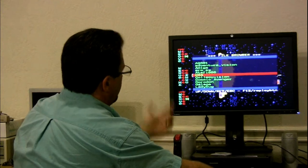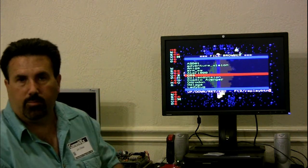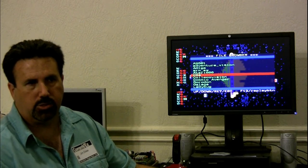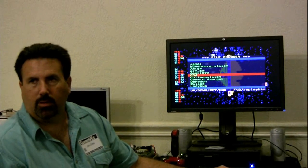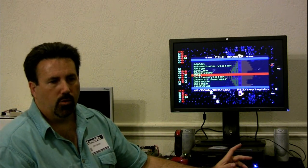Besides video games, they're also really into computer emulation. The reason this is taking a long time — this board has a copyright of 2011 — is that these guys are meticulous about doing exact emulation of chipsets. Mike's day job is doing engineering of chips and researching components. They took the SID chip and all its different revisions and did die layer extraction: you slice it down to the analog layer, x-ray it, look at all the microcells, and emulate it exactly. The VIC chip and Amiga chips were done the same way.